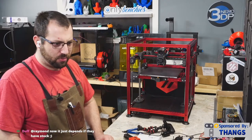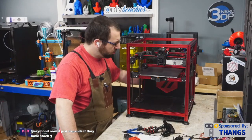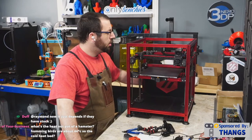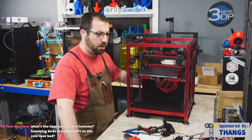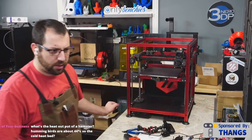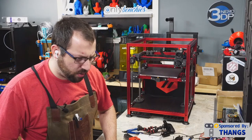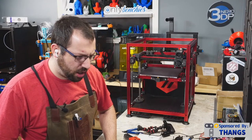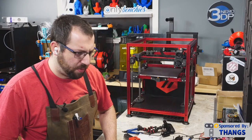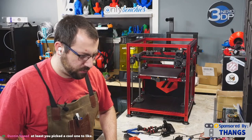Okay, we're back online. Let's try homing X again and see where we go. Oh! Why? God dang it. Okay, so X is good, but Y is wrong. If X is good and Y is going to the front, the steppers are swapped, so swap the A and B connectors. Dang it. Okay.